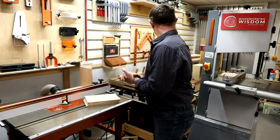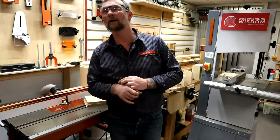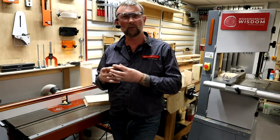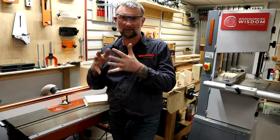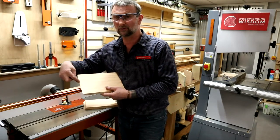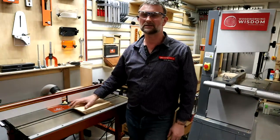Leonard is asking if you can use the cutter on a handheld router. No, a couple of reasons. One, the size, really. You can have a bit more control. And the tiniest little wobble with your router, and there's a gap in your joints. You will experience a gap halfway along your joint. That will be the frustration for you. So it's really router table use, this one.